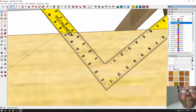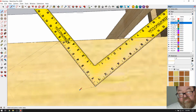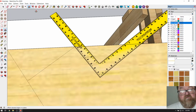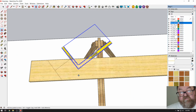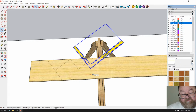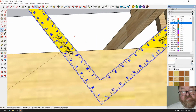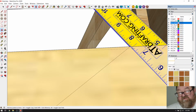Okay, then you're going to take, we're going to go out here. And for now, I don't trust this that much, honestly. But I'm going to see. Yeah, okay, that worked. All right, so you see what you're going to do is you're going to keep going. And I'm just going to save some time, I'm going to move the framing square, okay? But you're just going to move it down 7 7/16. Actually, that's not mathematically correct. It would be from here to here, okay?